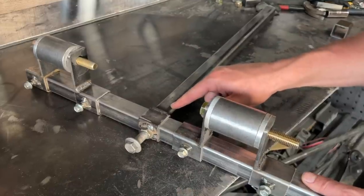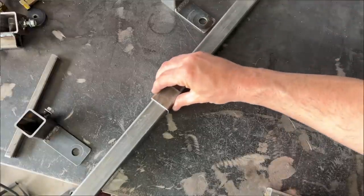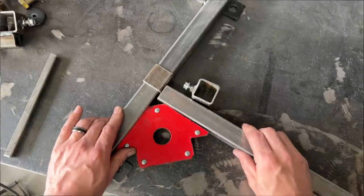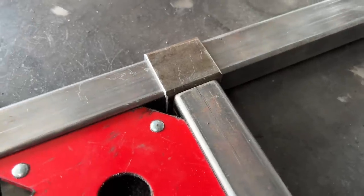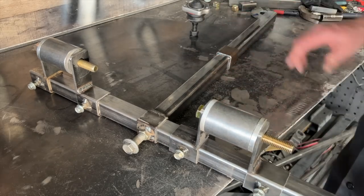I don't know why I used the biggest bolt I could find — it doesn't match and it makes my OCD ache. If you can weld two pieces of square tube into a T-shape with a 90-degree magnet, do that, but first slip a sliding sleeve in between them. The only piece left to make is the piece that holds the ball joint, so that's the sliding sleeve we're going to make right now.